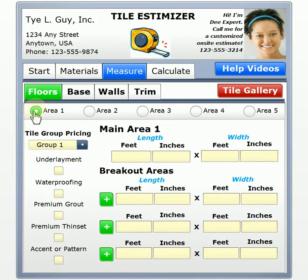But in terms of underlayment for flooring, these can be what we call crack isolation. There are soundproof barriers. There are uncoupling mats. There are all kinds of different types of stick-on, roll-on, tie-down underlayments. Too many to really get into. But generally, an underlayment is going to be something that helps prevent cracking of your tile because of the underlying shifting of the subfloor. So if there are cracks in your cement or anything like that, you want to get crack isolation. And again, your professional estimator can explain more to you. But in most cases, at the very least, you're going to need some kind of crack isolation underlayment. So that's what we're talking about.